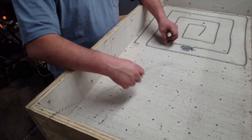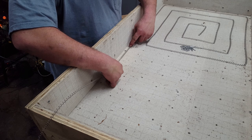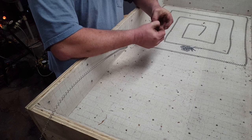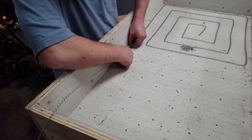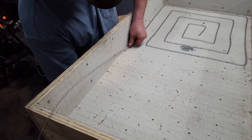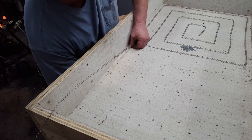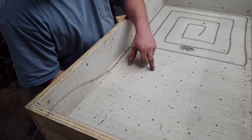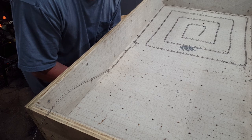All right, this is how you do it. All you do is put this heating element where you want it, then spread your cotter pin out just a little bit, slide it over the heating element and through that hole, and once you get it through the hole you just spread your cotter pin out — and there you have it. By the way, this is hardy backer board — cement board for tile. I got that idea from somebody on YouTube a few years ago.